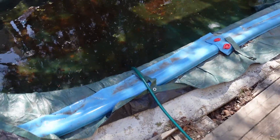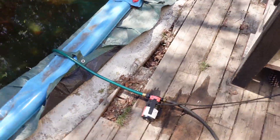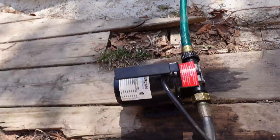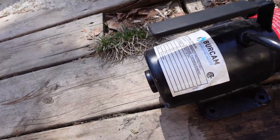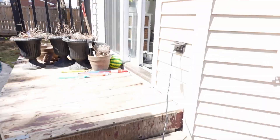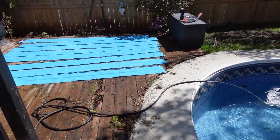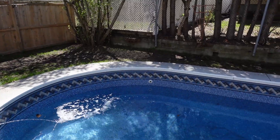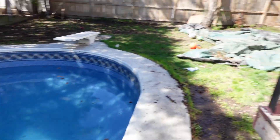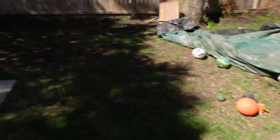In this video I'm going to be going over my steps to doing my pool opening. I put a tarp on this thing in the winter and obviously it's covered in leaves and filled with water from the snow melt. I use a little half-horsepower pump to clear off all the dirty old water sitting on top of the tarp, then pick up the leaves with a net. I got the water off, pulled off the water bags, pulled the tarp off the pool, and now have it slowly filling up with water from draining it in the winter.